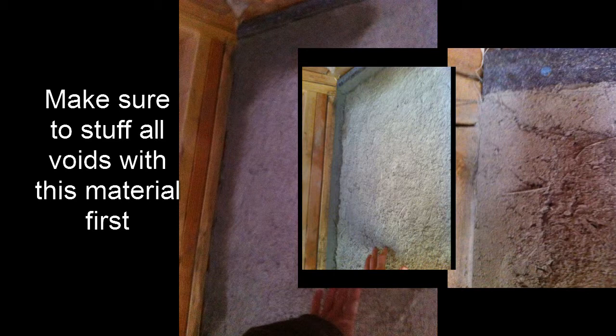I wasn't present when this wall was completely dry. It would have been interesting to show a photo of the juncture where the sandy bevel ended and where the compression step would have to take place. Was there suddenly a void between the clay plaster and the post, 2 feet down from the top of the wall? My guess would be yes.